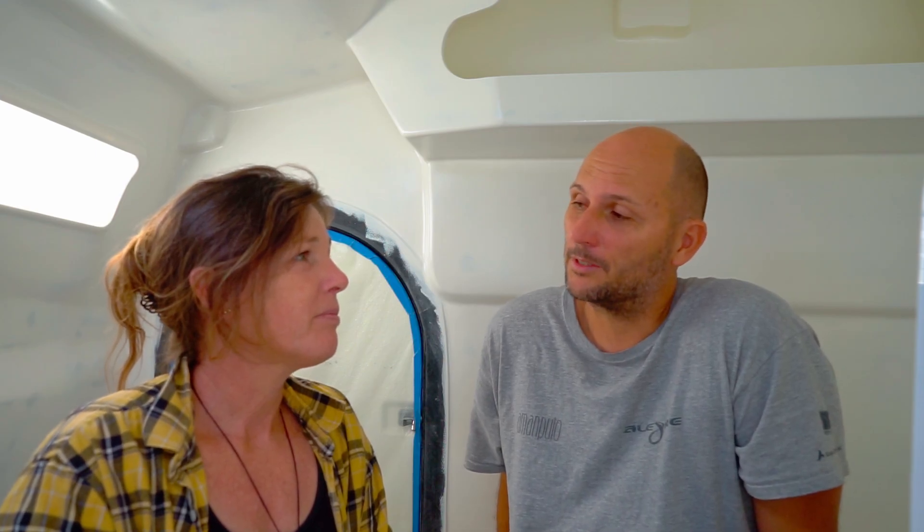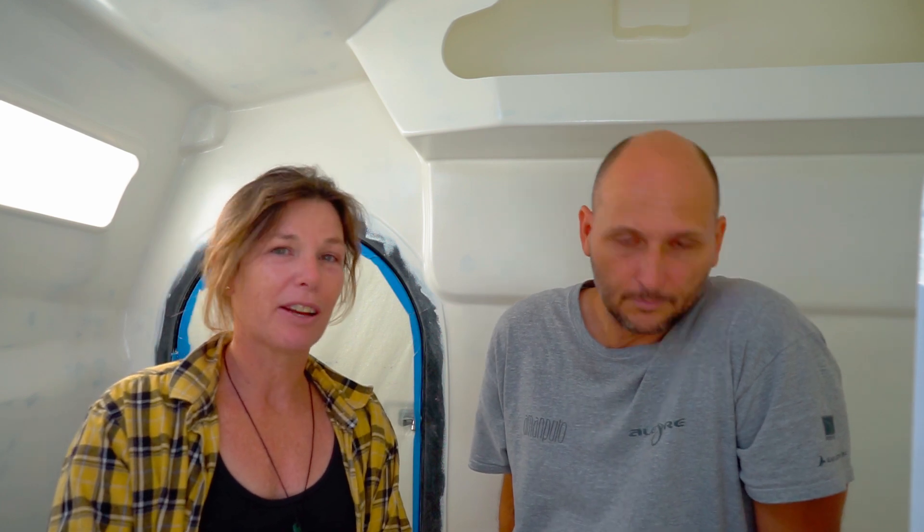It's also a custom shelf that adds functional storage without the weight penalty — that's a big bonus. It makes the room look amazing and we're really happy. Top coat is starting to go on now. It was nice to show you some of the tricks we use to speed the process up. Not everything has to be done in situ — building the shelf on the bench and even fairing and painting in the areas that are really difficult to get to is a big time saver, because a lot of people spend a lot of time sanding and fairing in hard places.